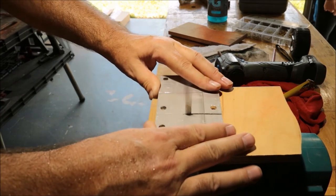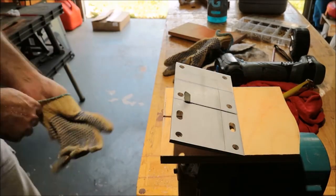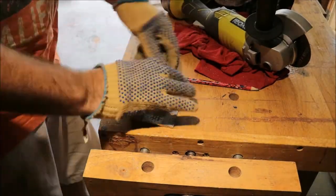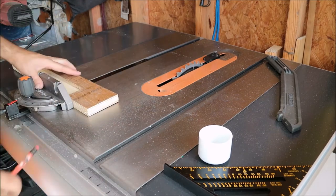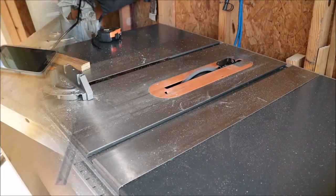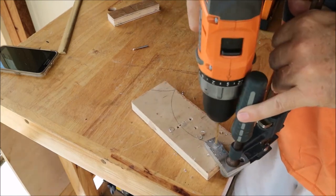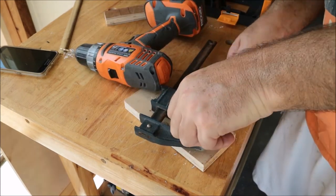Now I needed a stop and I wanted to try and make my own, and I did successfully make my own but I just didn't like the way it turned out totally. It turned out pretty good but I would have done it differently if I was to do it again. This is just some aluminum scrap that I had laying around — you could probably use a quarter-inch plywood or something to make these. It's just part of the hinge, and I had a piece of scrap plywood that I'm going to cut to use for the bottom of the stop. Now I'm going to pre-drill the holes in the wood and drill some holes in the aluminum to receive the screws. Of course I just broke my drill bit off.